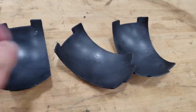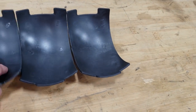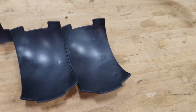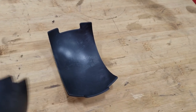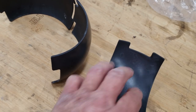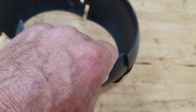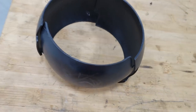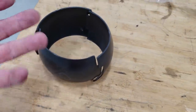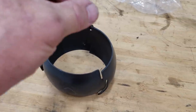This is the three-piece bearing for the drawbar on a CAT motor grader, the older style. I don't know what this is made out of, but they've made it three pieces, so it's a puzzle. To put it mildly, it's a nasty, no good thing to get in there. Hold all that together, slide those two big balls together, a pile of shims, run two Allen head screws through the shims into the balls and pinch it together.